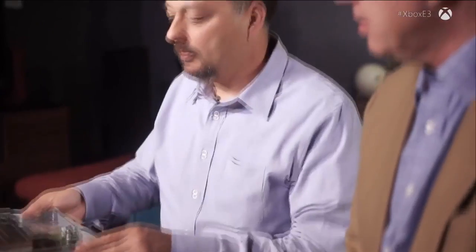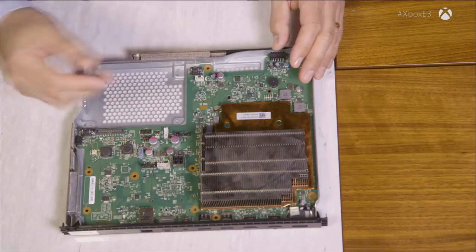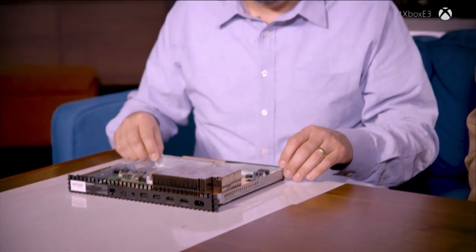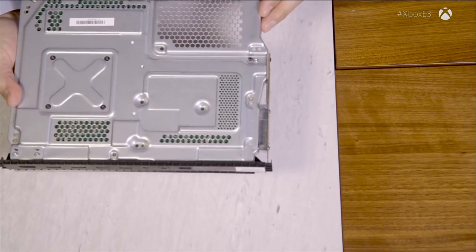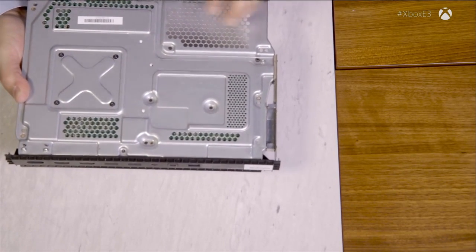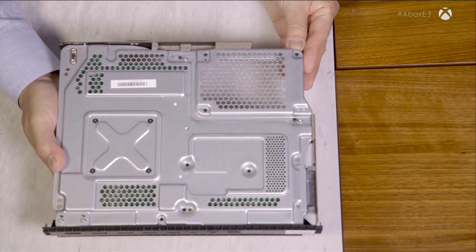Let's start building up the chassis. We use a two-piece steel chassis. Here's the motherboard with the heat sink added to it, sitting in the first half of the metal chassis — a metal pan. We use a fairly traditional approach: these are drawn out of solid sheets of steel. It's a one-piece drawn design with no seams. This entire tray starts as a flat piece of metal, formed in a series of punches so we have very precise edges for sealing.